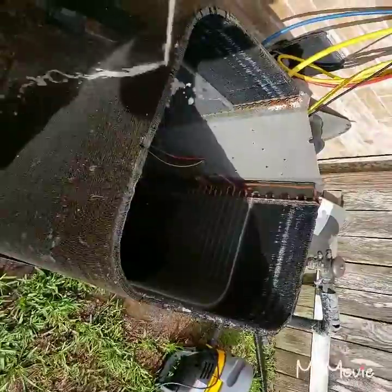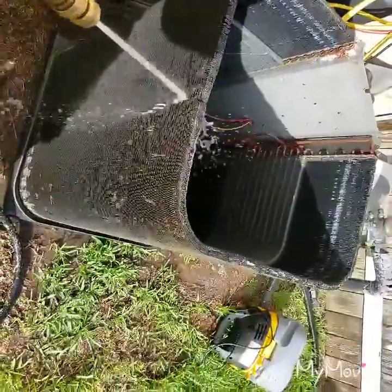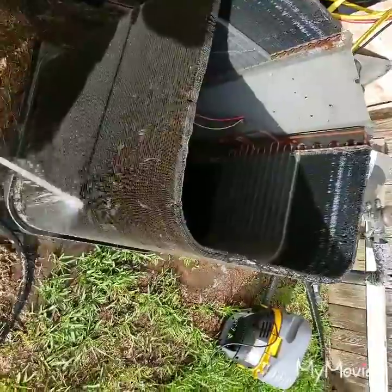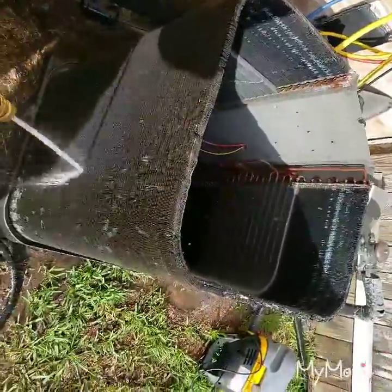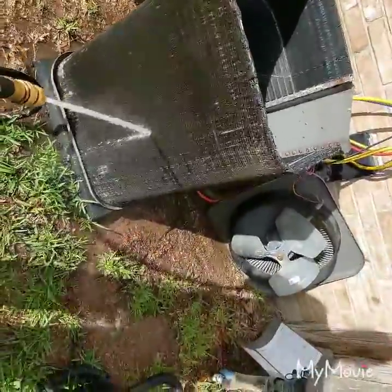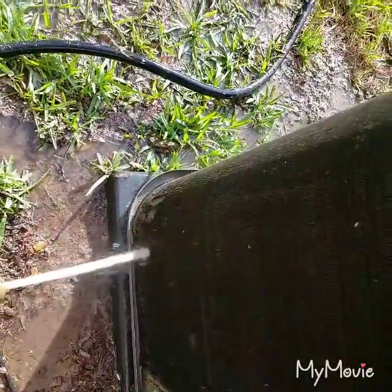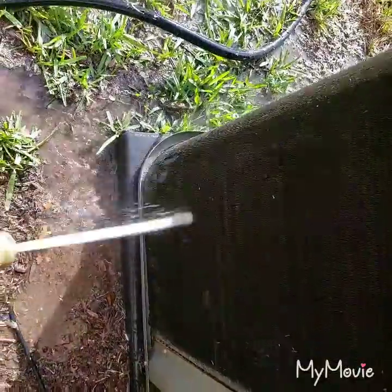If you're talking evaporator coil, it's hard to get to every spot - maybe you do got to put a little cleaner on there. Except some people ain't got the budget to let you take that evaporator coil outside. But yeah, take your time. Now I got all that dirt out of there, now it can breathe. When it rains, all that dirt will leak out the bottom of the machine.